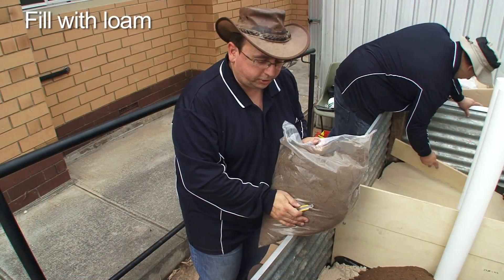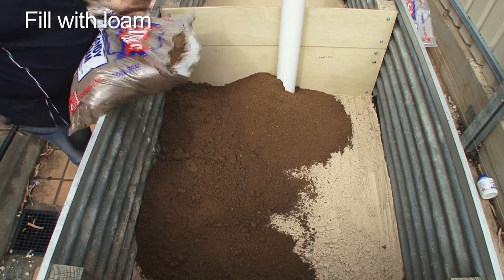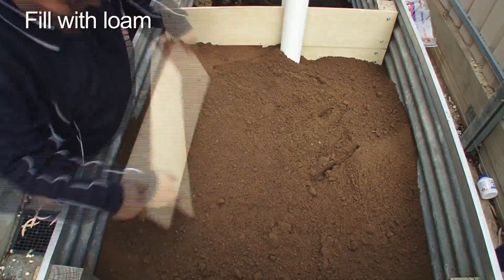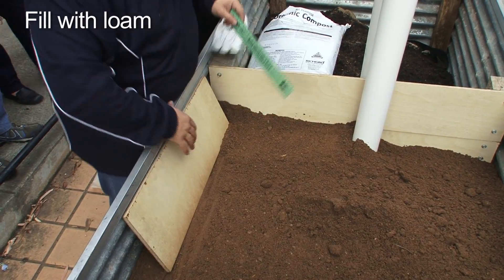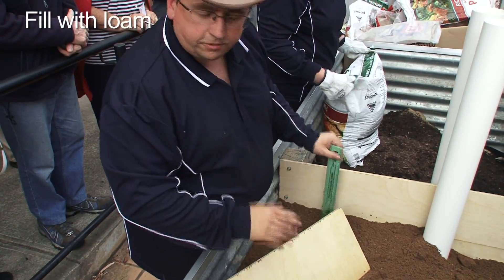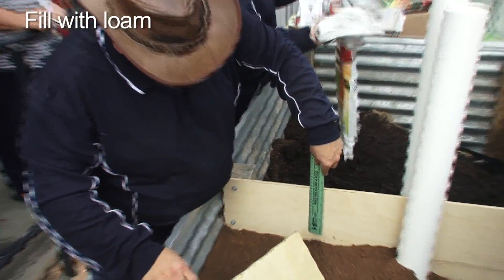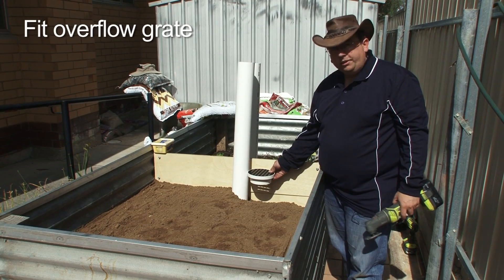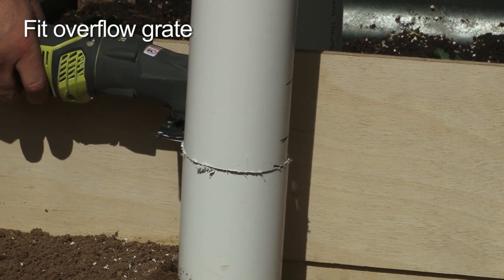Now onto the next step — the last actual soil step, but probably the most manual labour. We've got bags of sandy loam, which we now put over the sand layer. The bottom of that sand layer is the top of where our water well will be, and we fill this up as the section where all the filtration of the water occurs and where the plants will grow. We want a storage amount on top, so we finish about 100–150mm short of the top with the sandy loam. We're going to set our overflow level about 50mm down from the top, and we want the finished surface to be about 100mm off the top.